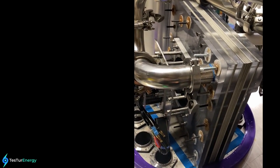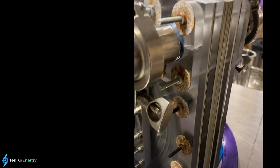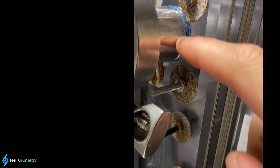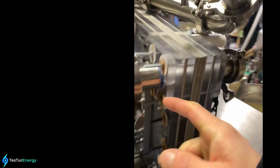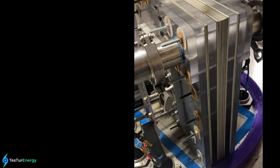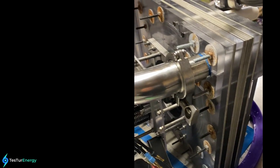I've now found the first breaking point in what I've designed, and I kind of expected this. The flange split open here on one side — you can see fracture points where it wants to go on the other side, and the other two both broke. So whatever power and acceleration we were getting, that was while these things were probably venting out a bunch — probably losing a ton of steam right out of the nozzle.